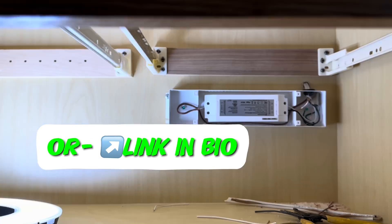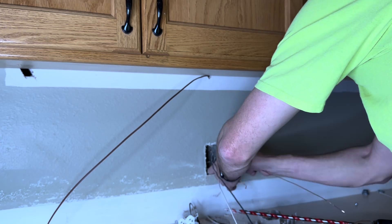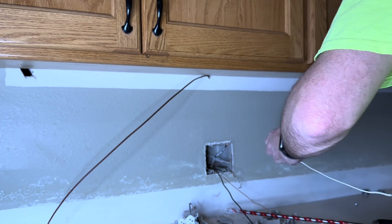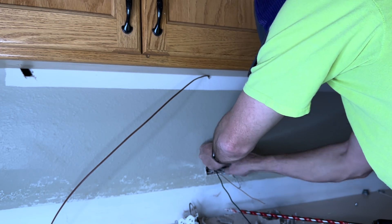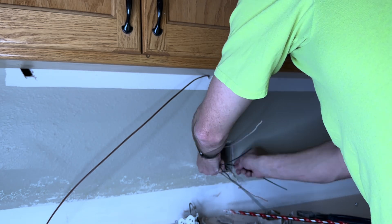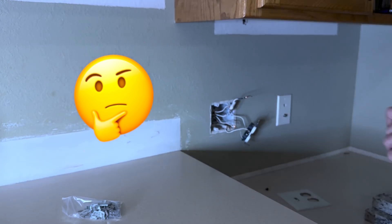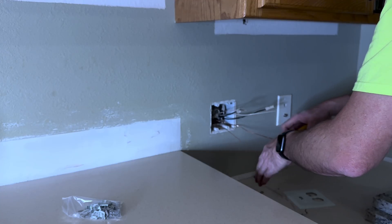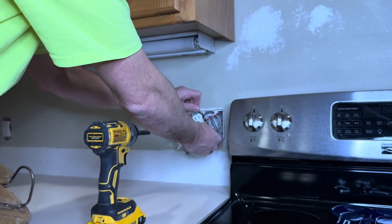There was a little path that I could snake that low-voltage wire through. It is marked output and input. Now you'll notice that I did get a box installed back in that hole. All I'm doing here is making up the switch. I had power in there because I had a receptacle, so I'm taking the neutral - the white - and tying it to the driver so the driver's got a neutral. Then I'm using the hot as the switched and the switch leg going down that I fed up to the switch as the switch leg. And then over here where that was a switch, I'm just turning it into a double receptacle.